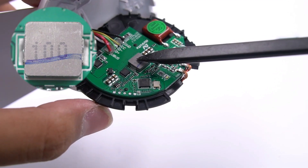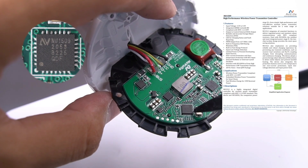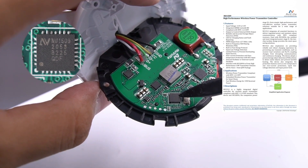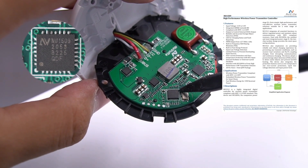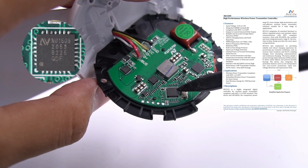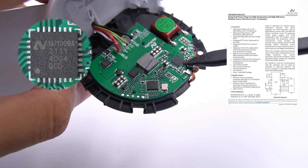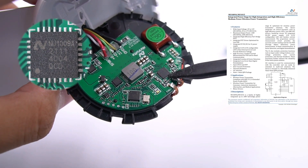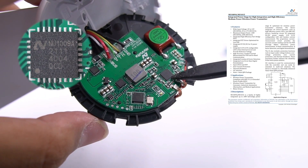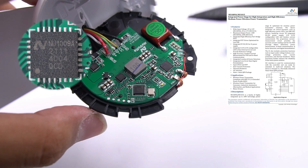Here is a shielded inductor. The control chip of the wireless charging transmitter comes from Novolta NU1509, which integrates an ARM M0 core and a high-precision FOD algorithm. It also has a built-in fast charging protocol and supports comprehensive protection. It can be paired with the Novolta NU1009A, which integrates a full-bridge MOSFET in the power stage for wireless charging, with a built-in switching regulator and LDO to power the master control IC and complete the protection function.